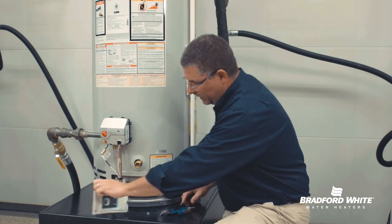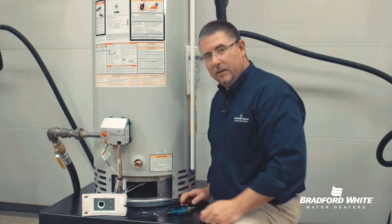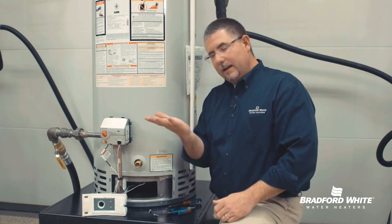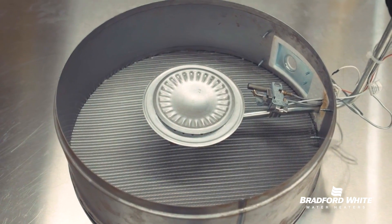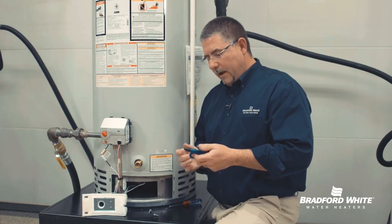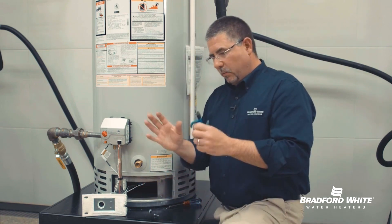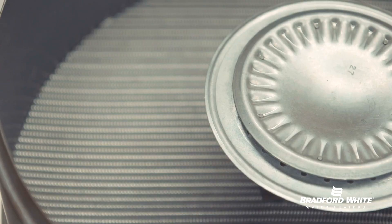We're going to open this combustion chamber. In most cases you'll be able to take just the one side loose and set it aside. The process here is that lint, dust, and oil are going to collect on the bottom side of the screen. Using a compressed air source — be it nitrogen, zero gas, something like that — maybe put a little wand or tip on there. Positive pressure blowing into this chamber, working to get those louvers clean. The screen is almost like a louvered system — get it clean.